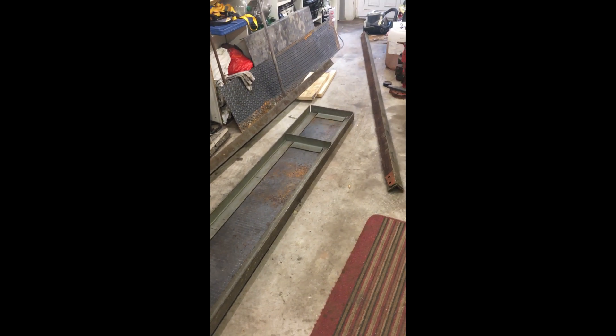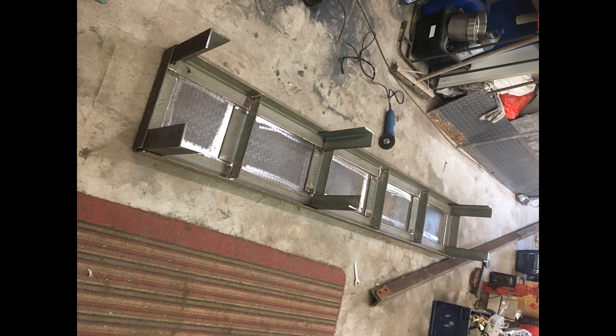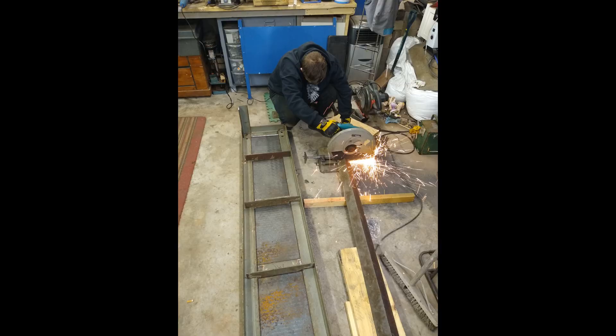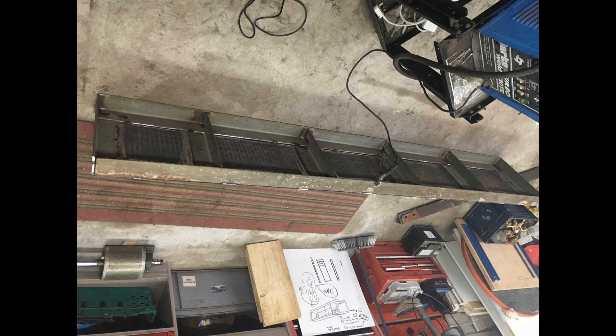This is building the basic frame. You can see we've cut out all the pipe shapes on the chop saw and laid it all out. We went for a full-length build even though we're going to be doing mostly mini bike stuff on it — we thought, we'll do it once and once only. There's me chopping it up, and that was me tacking and welding it all in place. We were quite happy with it to be honest.